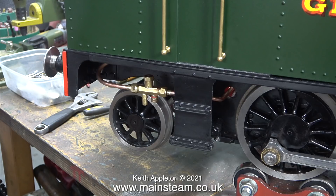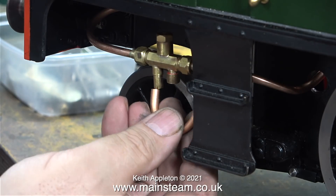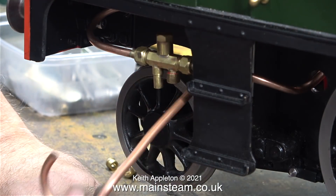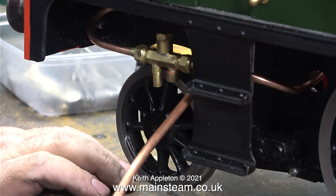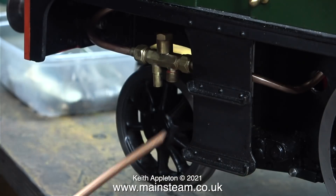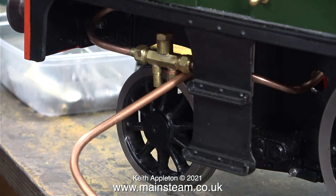There are certain rules you must not break — the water that feeds an injector needs to be cool. You always have to turn the water on to this type of injector first and let it run to cool the injector. When fitting this piece of pipe I want to make sure the water pipe is not above the steam pipe, as the heat from the steam pipe would heat the water going to the injector and you could have problems. This clip is running at four times normal speed to show how many times I took the pipe out, re-bent it, and put it back in.